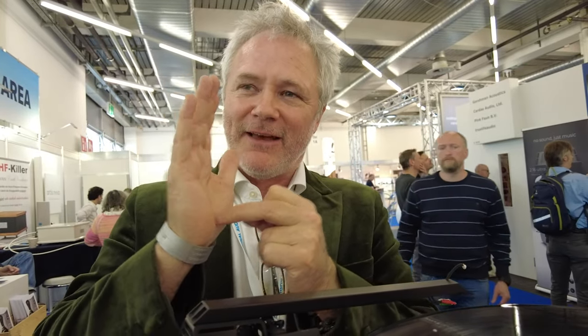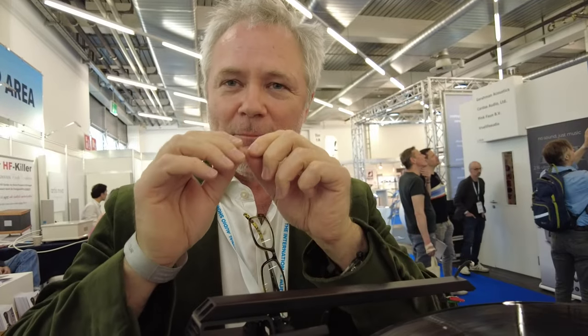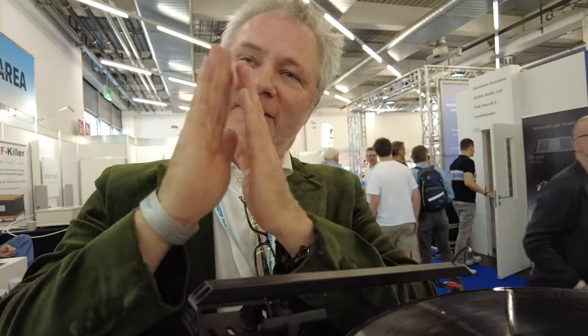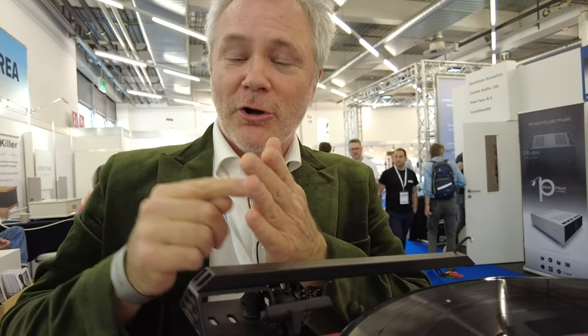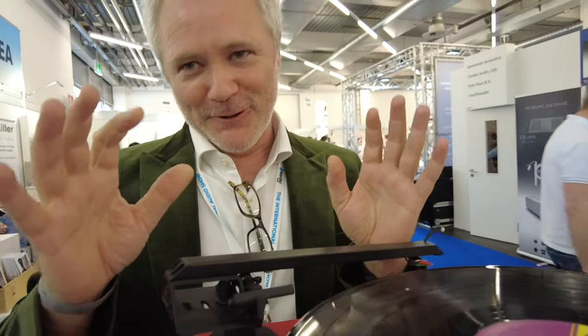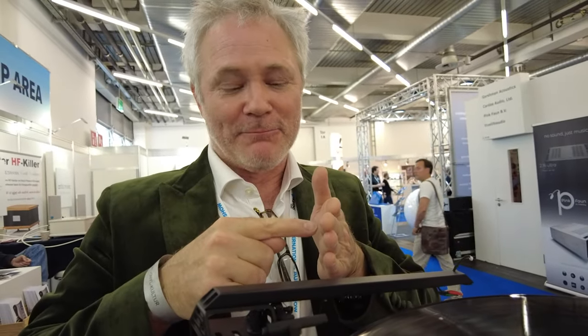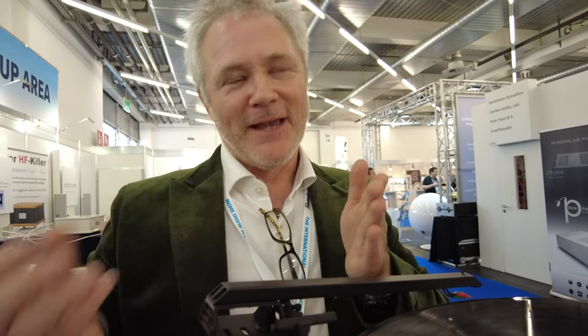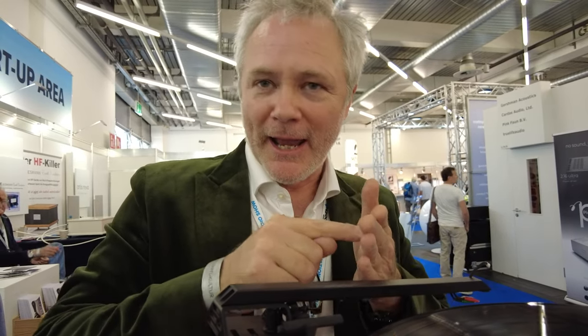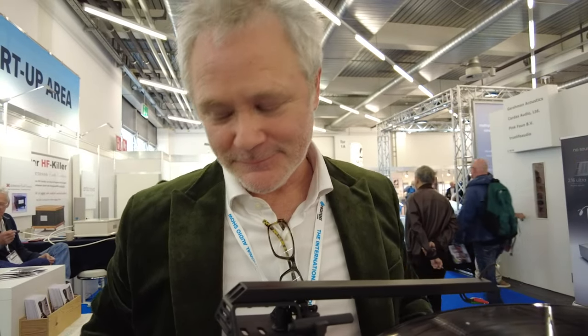The reason that it needs a little bit of magnetism is that the ideal behavior of the bearing happens when the two hoists are in a vertical plane exactly, and then you get the best spherical geometry. To have them exactly vertical, your contact pressure at the bearing would be precisely zero, and obviously it's difficult to set up a hanging bearing with precisely zero pressure. So the easiest thing is you put a magnet on, and that gives you a little bit more pressure, and so you have some leeway at the bearing. So is your plan to manufacture and sell this, or is your plan to license the technology?